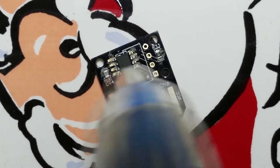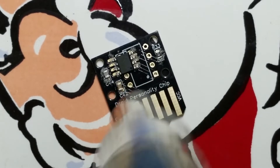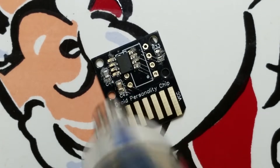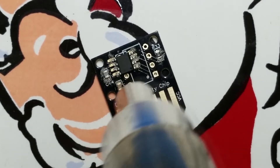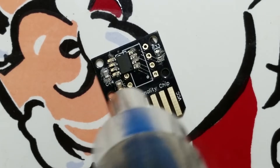So there's the gun. I'm going to start a little bit above — probably about two, three inches above. Right now all I'm doing is trying to heat up the PCB. I want all the copper on the PCB to be at roughly the same temperature. Then, in theory, when I zoom in real close, things should melt fairly quickly.